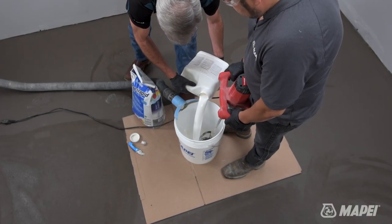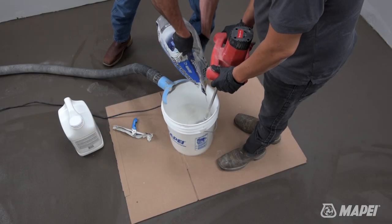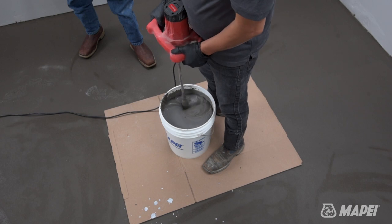It's time to talk tools. From a contractor perspective, having the right or wrong tool can make or break a job. For mixing, we use a slow speed drill — about 300 RPM — with a specific spiral design mixing paddle that promotes mixing without entrapping air. The spiral paddle pulls from the bottom of the bucket rather than the top down, which prevents air entrapment. Be sure to check your drill speed because many drills on the market run at 450 RPM and up. Too much speed and you entrap air, which is the big problem.